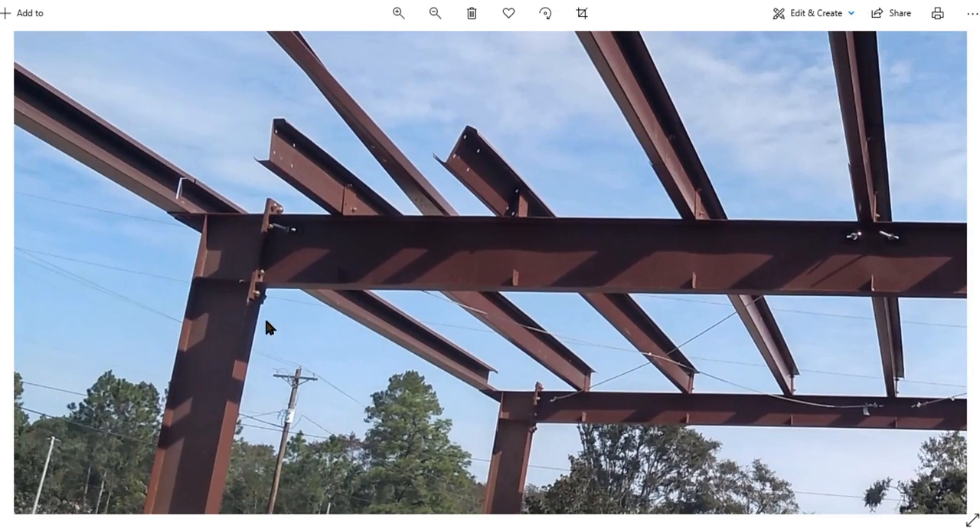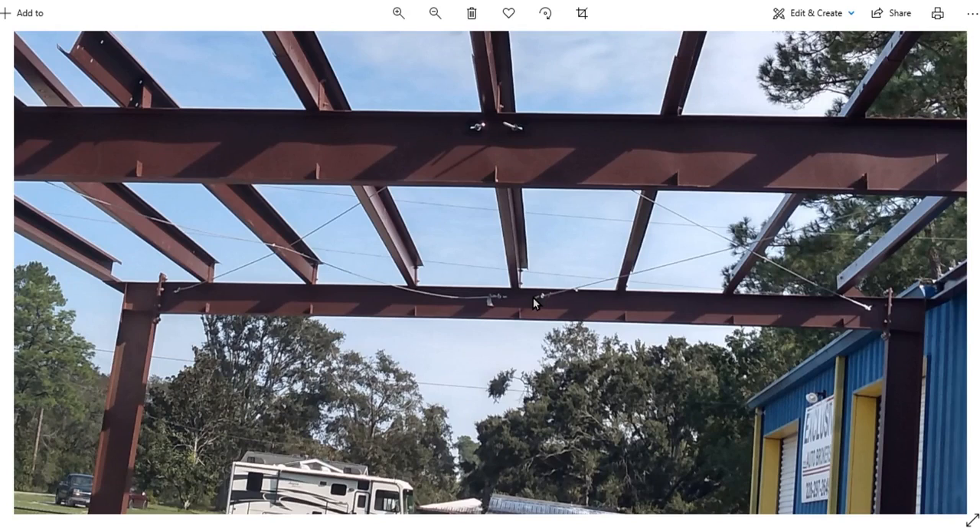All this rigid steel — all these bolts that go in this rigid steel — gets tightened as you put it in. But anything that goes in this rolled form, this soft metal, you just leave those bolts loose until you get everything bolted up and everything's got a bolt in it. Then you come back and tighten all the bolts up at once. These X-bracing straps go across here — you want to get them in on your second column, wherever they're going. That's the first bay you want to put up.